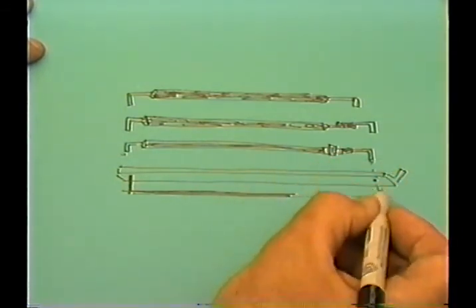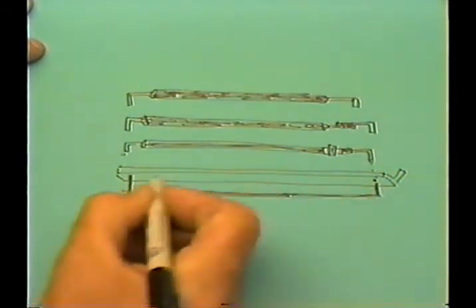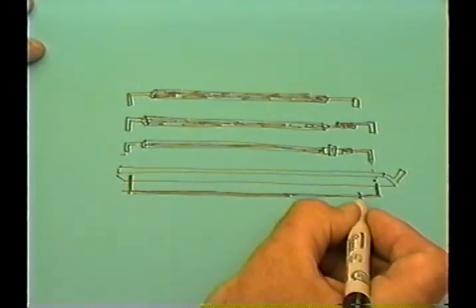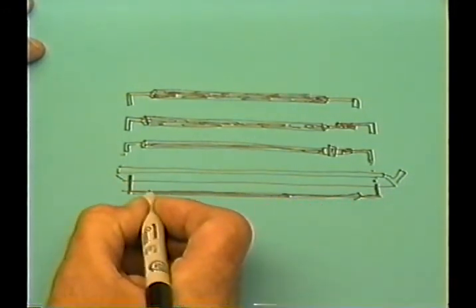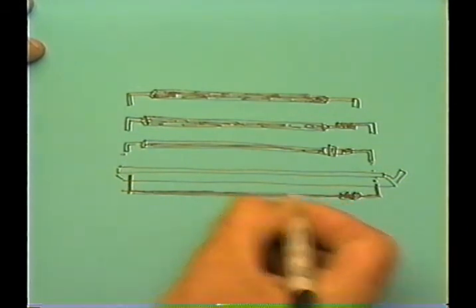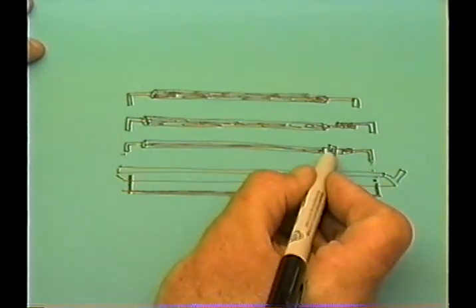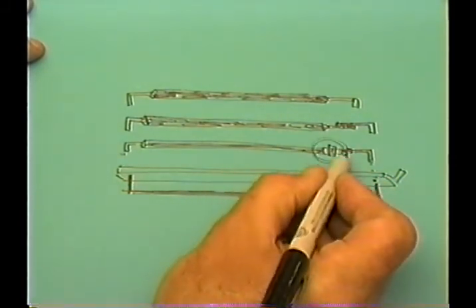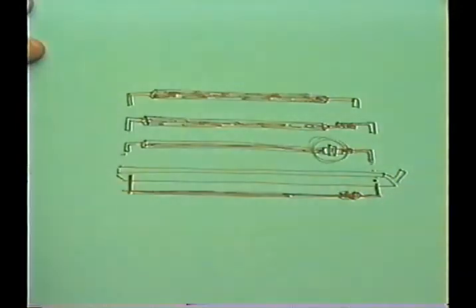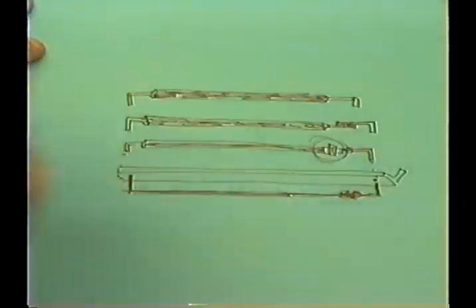But this would be a tool to use to set up your final push rod length, which you could mark, and then build yourself a push rod with a little slop in the ends, and then fill it with carbon fiber the way we've done a million times on video. And that gauge, now you'd eliminate this part, and you could use it again in the next plane, assuming you're building a plane with the same tail moment arm. If you weren't, you could just take it out.